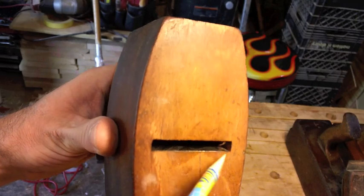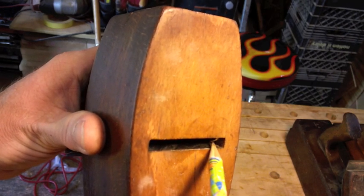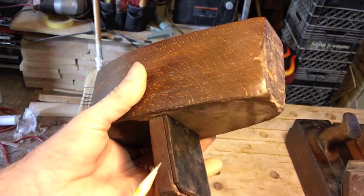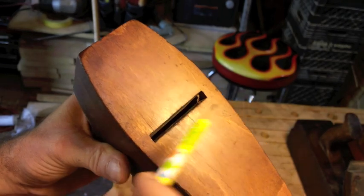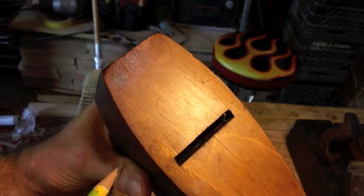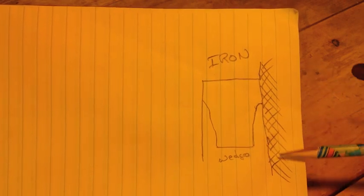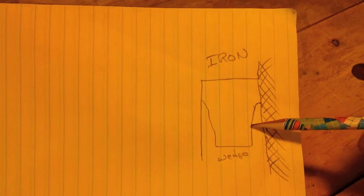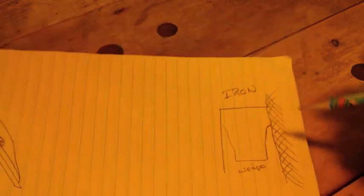With the iron in and forward, what you don't want to see is the tip of the wedge protruding beyond the bevel of the iron. Most likely if it's protruding, this is not the wedge that came with this plane. You can shorten it and bring it back, but you have to keep a little bit of an angle and keep a point — you don't want anywhere for a chip to catch. This is your iron, this is your wedge, this is the side body of the plane, and you want the tip to come here and meet the side body of the plane as tight as you can.